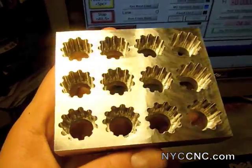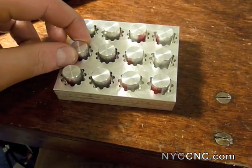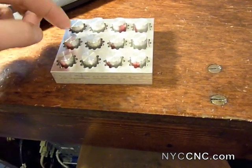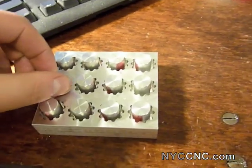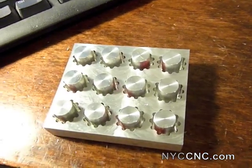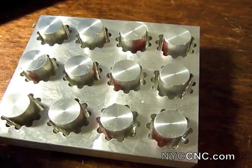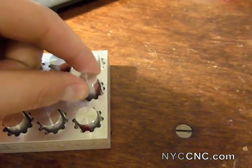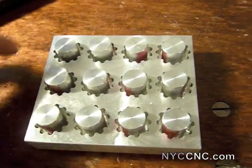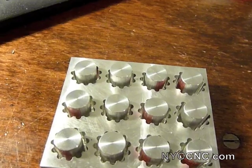I have inserted my half-inch aluminum dowel rods, which I cut on the lathe. You may ask why I use these instead of steel dowel pins — two things: these are actually cheaper and didn't take long to make. Also, I may contemplate adding a perpendicular shaft through each of these to create the requisite hole in the part versus having to drill it after casting. I'm really happy with the fit of all the dowel pins — one of them is a little bit loose, but I experimented off-camera by pouring water in each one, and they're all watertight. So the viscosity of the molding agent should be fine.